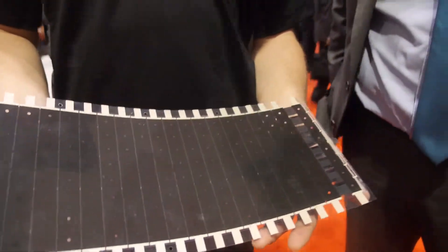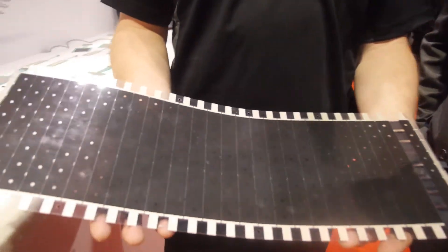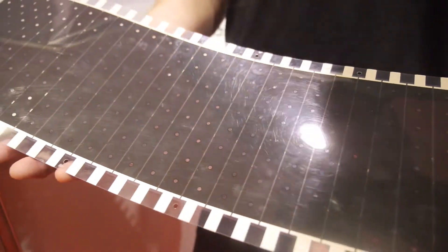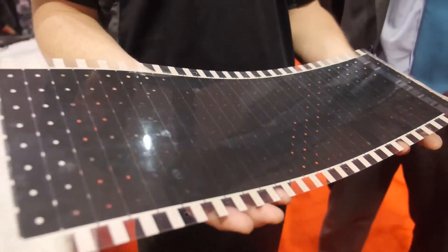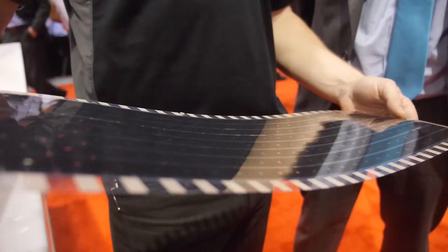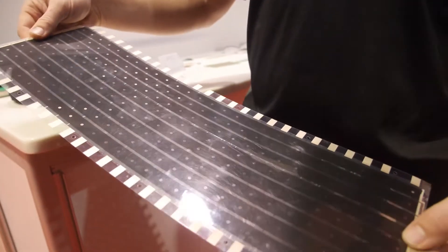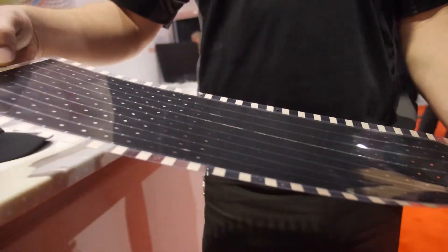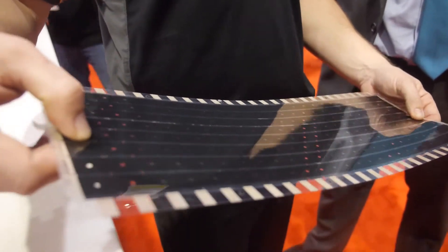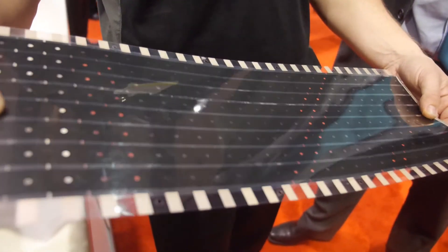Kurt, tell us what are we looking at here? You're looking at a Matrix Array through-mode force sensor that can be found inside the little instrument that's currently being played by Phi Bui. It's a force sensor that allows the musician to expressively interact with their instrument and with their music. They do this through force sensors, which allows you to push through a force sensing ink that gives you a variation in conductance, and that's then interpreted by the electronics of the instrument to give you changes in pitch, in timbre, velocity sensing and all that sort of thing.